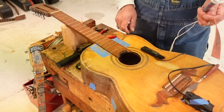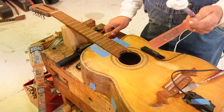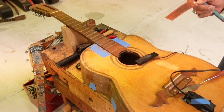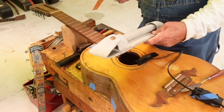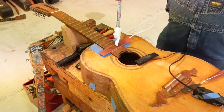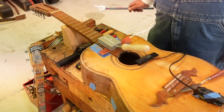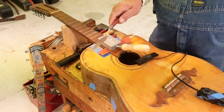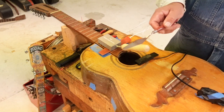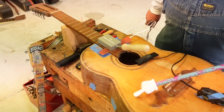What I've done is cut this down using this as a fret and the width of the pickup here. I used this kung fu theater ginsu giant knife to cut these down, and now I'm heating this up to break the glue loose underneath this section. Once that's heated up sufficiently, take the palette knife. The benefit of using this instead of granny's iron is if this is not hot, you won't burn or mar this finish — which is one of the most beautiful things I've ever seen.